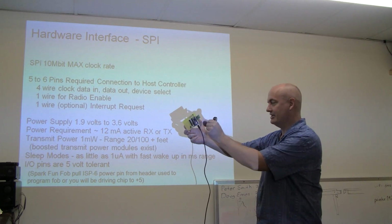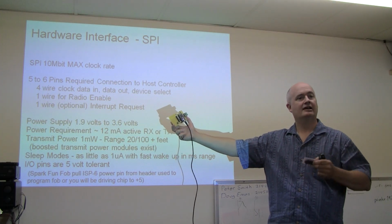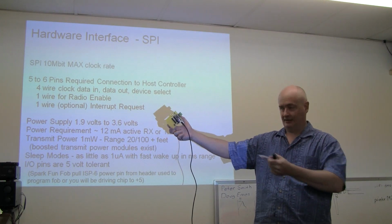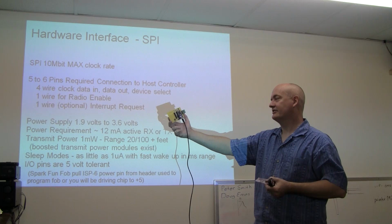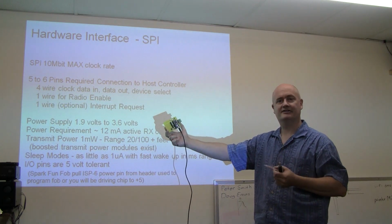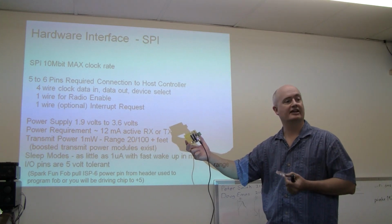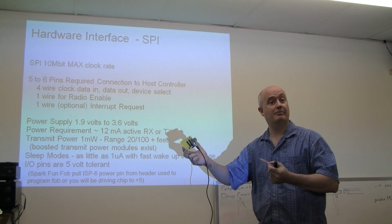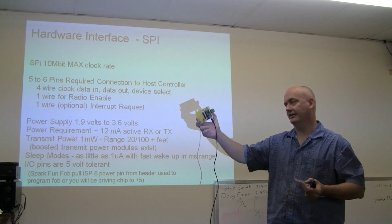The reason I mentioned that is I just noticed today that they had a nice little library designed to talk to this radio chip, this Nordic Semiconductor nRF24L01 Plus chip. Somebody had written a nice little library, and I thought to myself, rather than talk about how much I suffered writing low-level code for this thing, let me see if I can download the code to this mbed and describe the pins that I had already hooked up on this proto board.